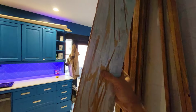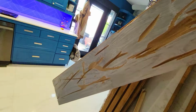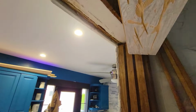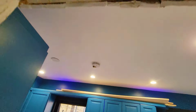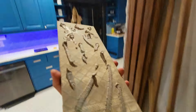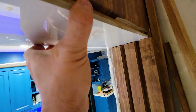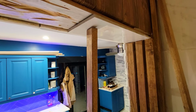So we decided to take this floor plank, we scratched it up so there's some adhesion for the glue, and we're going to place this here. The reason we're doing this is because we are missing some height here before we place the tile on. So now we're going to screw that in, and now we're ready to place our glue on this tile. We're placing this right here, push this in, and now we're going to support that with this, and then this is going to essentially just dry overnight.